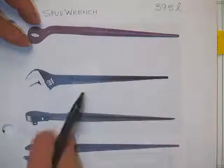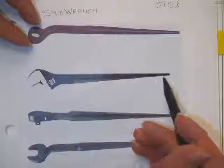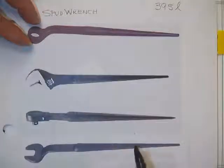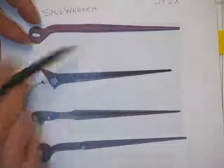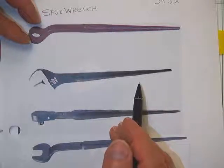Well, I think mostly they use this for when the pieces of steel are coming up, you know, the holes aren't lined up. So they'll just stick this in there and bring the other one up, till they get it on there, and then they wobble it around until all the holes are lined up with each other. Then they leave that there and they stick a bolt somewhere else. That's a drift pin.